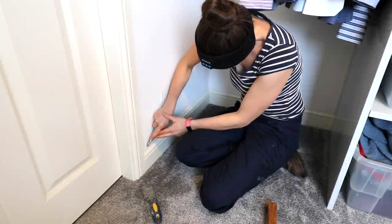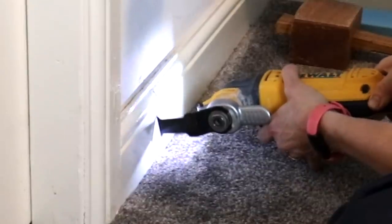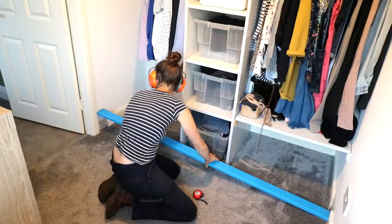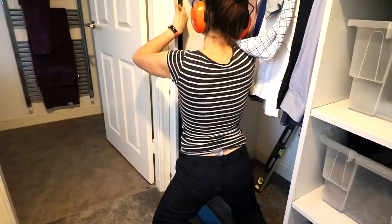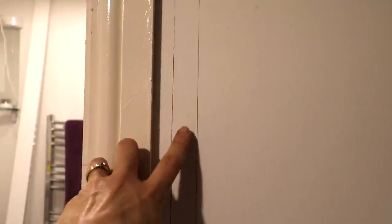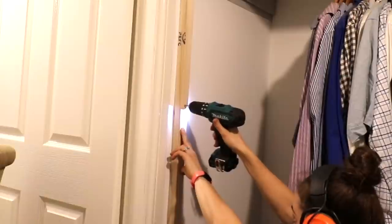So I'm now back at home. I'd originally planned to leave a two inch gap from the front of the top shelf, but as I had door architrave around here, I thought it was best to position it next to it, leaving a few mil to play with, and cut out with my multi-tool, and copied the same distant measurement from the skirting board on the opposite side. Then I could fit the bottom plinth across the floor to start planning where I'd screw a mounting baton on the wall either side. There was a bow in the middle of the architrave, and to straighten it I temporarily stuck coins along it and checked with my spirit level, and drew the thickness of my trim, filler piece, and baton. I drilled and screwed the plinth down in line with the back of the trim, and after drilling holes in the baton, I'd line it up with a final mark and drill through it again to mark on the wall.